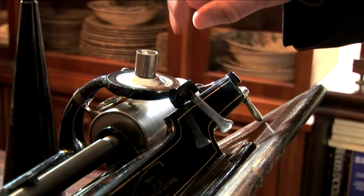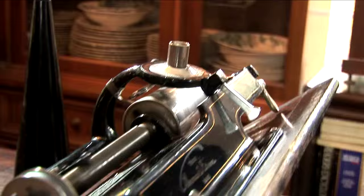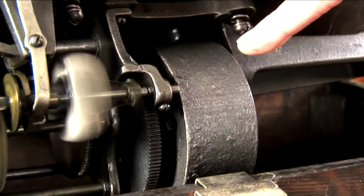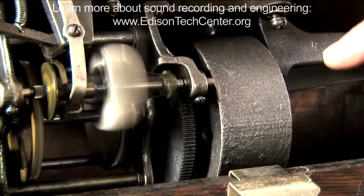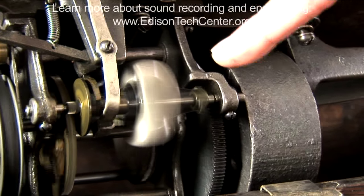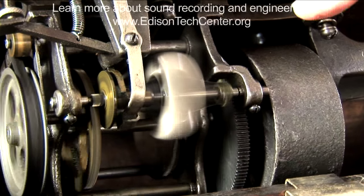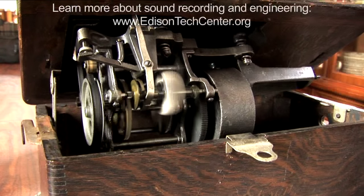It isn't the needle riding in the grooves that moves the record the way it does in more modern recordings. Inside, you can see the guts of the motor. This thing rotating around is the spring contained within a cast metal jacket, because these springs are very, very powerful, and occasionally they broke — almost explosively — with the amount of energy stored. This is the governor spinning around here, and its construction would be familiar to anybody in the 19th century as the same sort of governor they used on a steam engine.